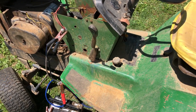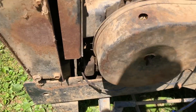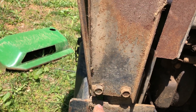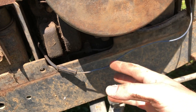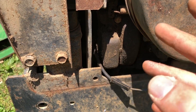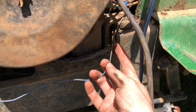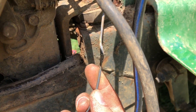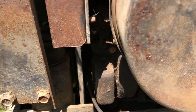So it turns out I was wrong about pretty much everything. This wire right here is actually for the power takeoff electromagnetic clutch - that's what it's for, nothing to do with the magneto. I don't know what I was thinking. That said, I still have to fix that frayed wire regardless - it's still a problem.